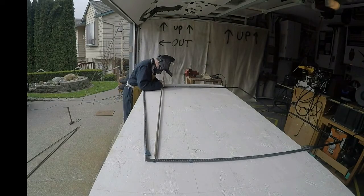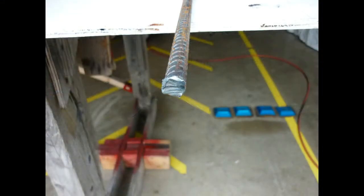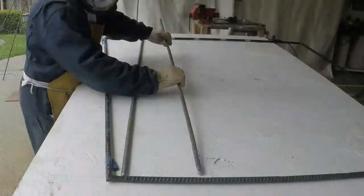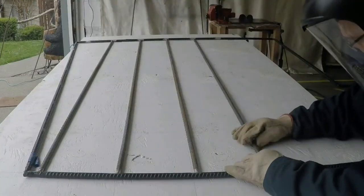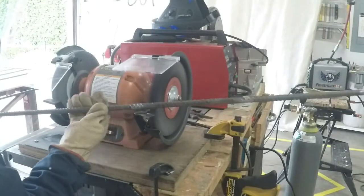The long pieces will run horizontally. The plasma cutter will slice right through it. It will, however, leave an end that's not conducive to welding. Take it over to your grinder and clean it up. Then use your wire wheel to clean at least an inch. Complete this same process for each of the cross pieces. You can see the exposed line on our template — we're going to place short pieces of rebar there. Head back over to the wire wheel and clean every place where you're going to weld.